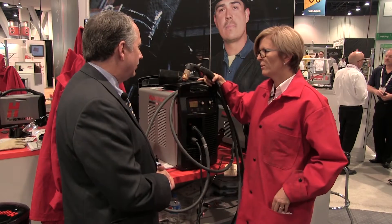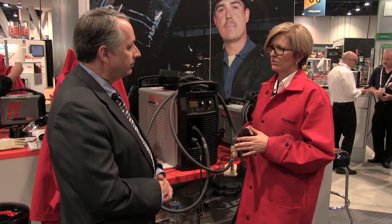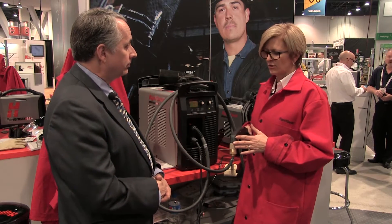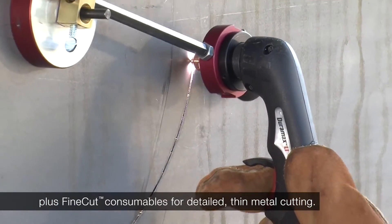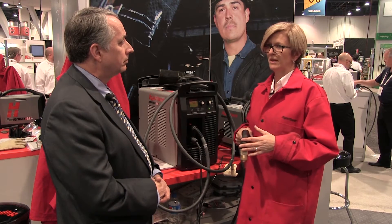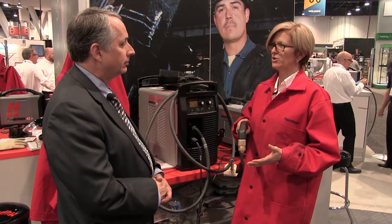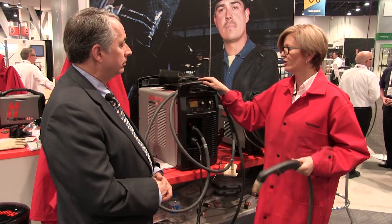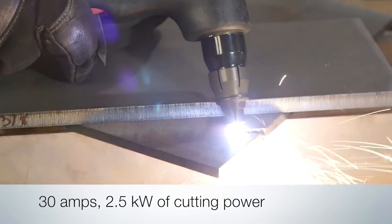Yes, correct. Hypertherm has developed shielding technology, which means you're able to touch the surface with our consumables when you cut. This allows you to use a steel jig or a steel plate to drag along the surface and guide yourself — making it much easier for someone who has never used plasma before to get good results. With oxy-fuel, you need to preheat the surface, adjust regulators, maintain a steady hand and distance. With plasma, you just place the torch, power up, fire it, transfer the arc, drag the surface, and you're ready to go. The SmartSense technology handles all the parameters, so the operator just puts on the right consumable, selects the amperage and process, and does the job.